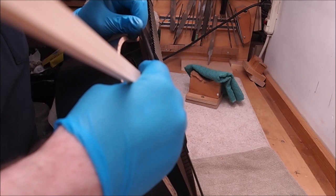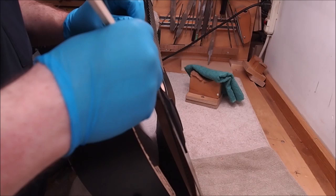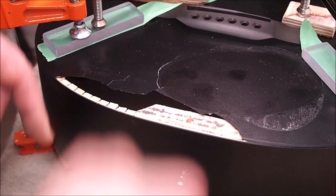Then I got inside with a very long, very tapered stick to apply some slow-cure epoxy to the X-brace arms. I used a combination of clamps through the sound hole and also jacks from the inside of the guitar to get it all clamped up.